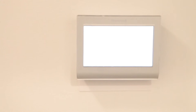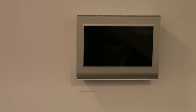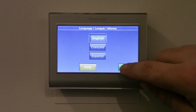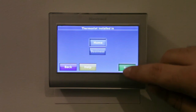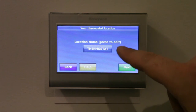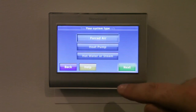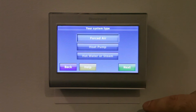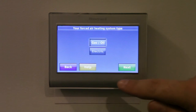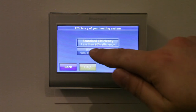And success! I was really happy to see it turn on — I wasn't 100% sure I was doing it right, but I figured if you plug a wire into the right letter it should just work, and here it did. It went through the booting sequence and the basic setup: asking how you want to use it, what kind of furnace it is, whether it's forced air or circulatory, whether it's gas or electric. For me, I have a 90-plus high-efficiency furnace, so it asks for that as well.